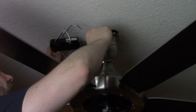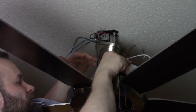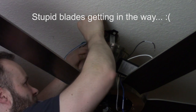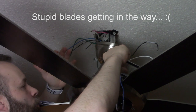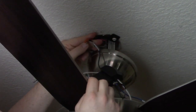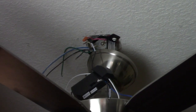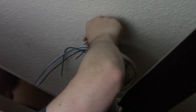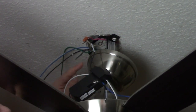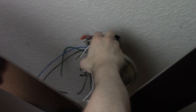This is exactly what I was talking about — having all of the blades up here, it's just like, who comes up with this? Let's put the cap on and hope the connection is done well. Because we don't have a lot of space here to play with, I would much rather use different, bigger caps that make a more secure fit. So as I'm connecting wires, I'll start bending them in and hiding them already, to clear out the space so this thing can still slide in there somehow.